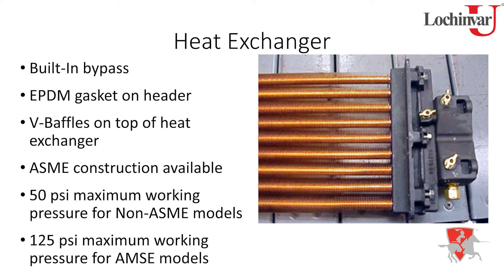The gasket is replaceable — you can pull the head off and replace it if needed. Where the copper tubes go into the cast header and footer, they are actually swedged in, so there's no gasket in that area. The copper fins on the heat exchanger are extruded from a thicker copper tube — it's one solid piece, not brazed or welded on. This extrusion process thins the inner wall but creates fins that provide greater surface area for heat transfer.